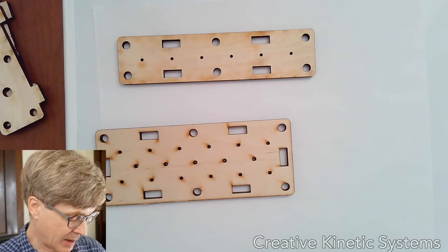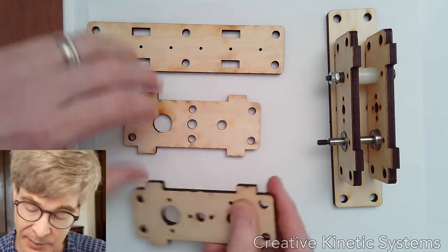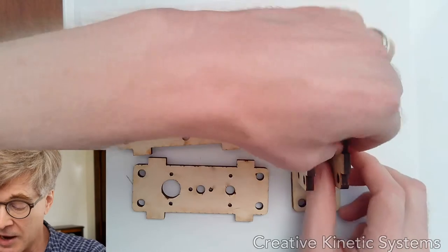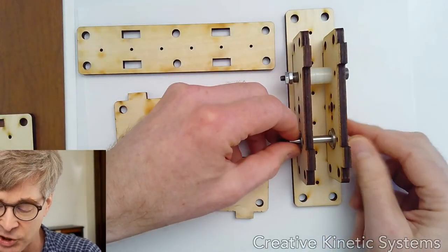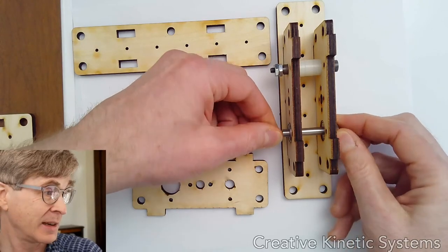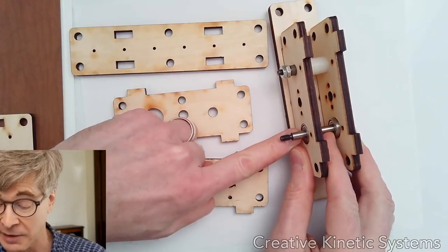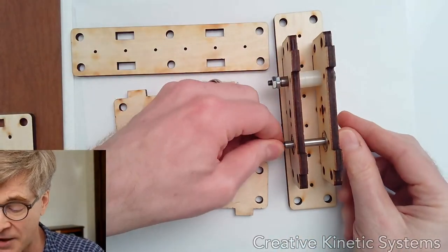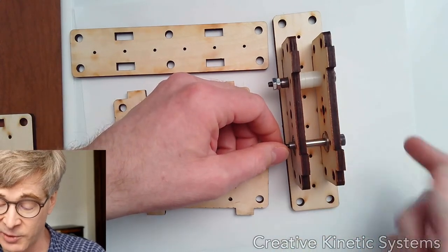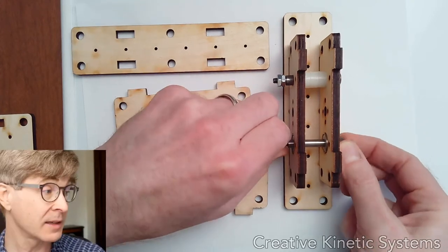Here's a specific example: I've used a couple of the narrow breadboards and a couple of the side tab parts. This version has a motor pattern in the center, and I've shown a way to provide a couple of bearing structures. The larger ball bearings are not a tight fit in the holes — you might need to shim with a little paper or metal foil, or use a very tiny amount of glue just to keep the ball bearings in place. Here we have a shaft pivoting on a pair of ball bearings fit into the wall of the side tab, providing a really nice robust contact. Loads on the shaft can come from the inside as a clevis mount or from the outside as a cantilever support.